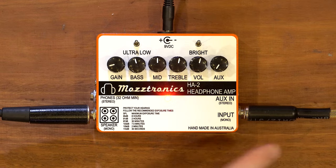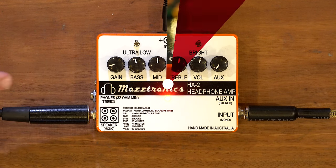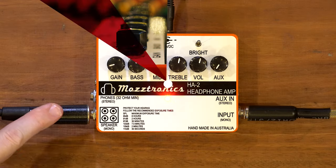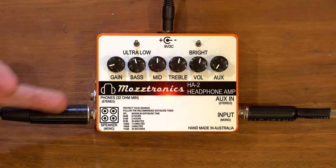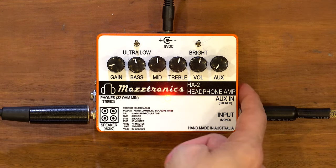It can be used as a little practice amplifier - it's only one watt. What you can do with it: you have an input, two headphone outputs - a little headphone jack and a normal guitar jack sized headphone output. You also have a speaker output that can go into an eight ohm speaker as a one watt practice amp. There's also an auxiliary input so you can play along with an MP3 player.